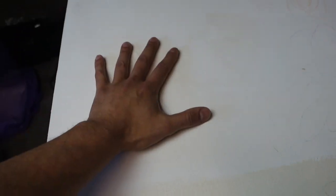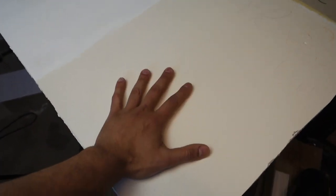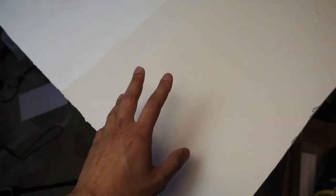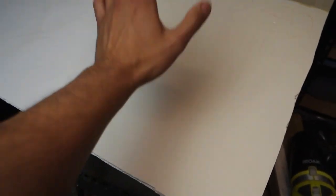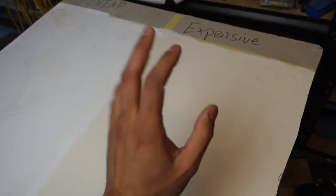Like I said initially, you could feel the difference between the two. So this one here is a lot more chalky, which means it's more porous, and therefore we've got permanent stains stuck in that paint now. This one here, on the other hand, obviously has some sort of protective barrier built inside that paint, and the manufacturer did also say that it is more resilient to stains and scuff marks, so very happy to see that these ones here did come up. On the top, we've got our crayon and pencils. Really struggling to get these ones here off on both paints, cheap and expensive. I think that's to do with the fact that these are oil-based and I'm trying to use water to clean this up. So all in all, this is the finished product, cheap versus expensive.